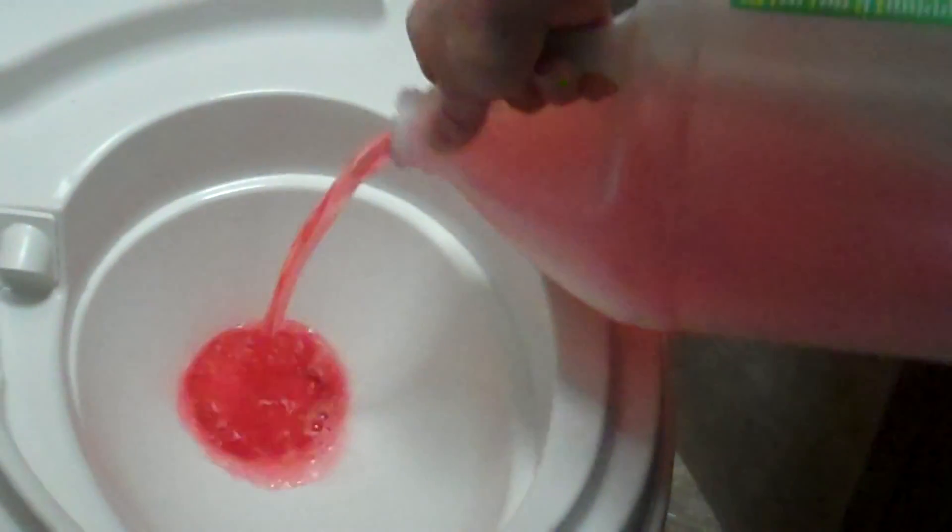I'll run a little bit of that just in case there's a little water left in the tank. The whole idea for the bathroom is to keep the seal moist. And a little bit down the drain of the shower - about half a gallon total.